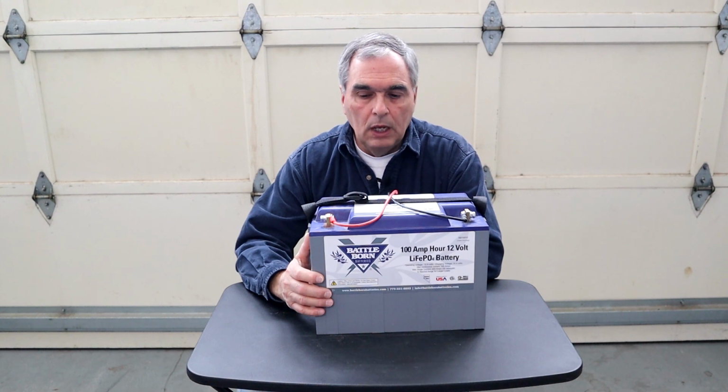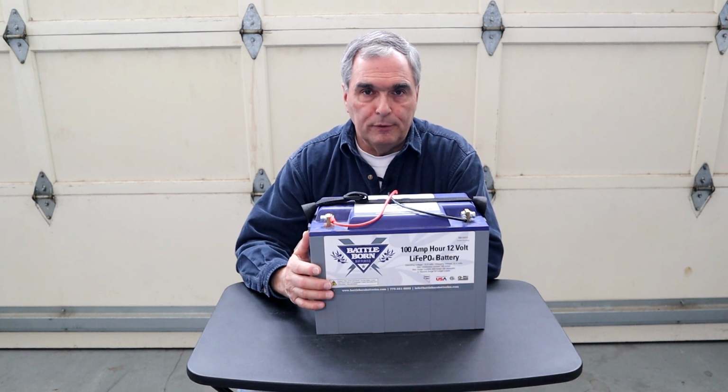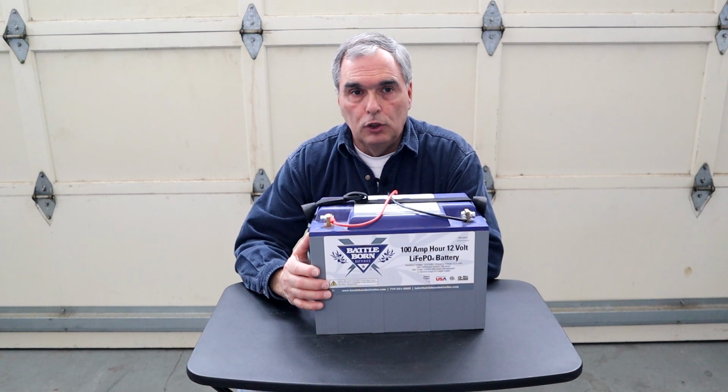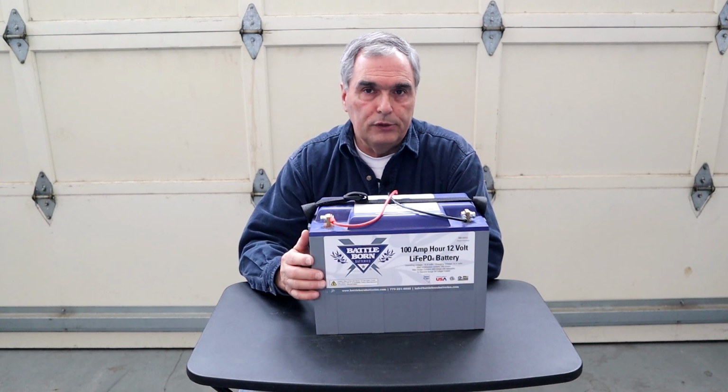Another critical difference between a battery built with cylindrical cells and one with prismatic cells is it takes 120 cylindrical cells to make up this 100 amp hour battery from Battleborn. I'll even provide a link below to a teardown video that shows you what you can see inside this battery. In contrast, these prismatic cell batteries use 4 individual prismatic cells to give you the 12.8 volts at 100 amp hours. Now, if one of those prismatic cells goes bad, the battery is no longer useful. On the other hand, if 1 or 2 cylindrical cells in this battery go bad, you probably wouldn't even notice.